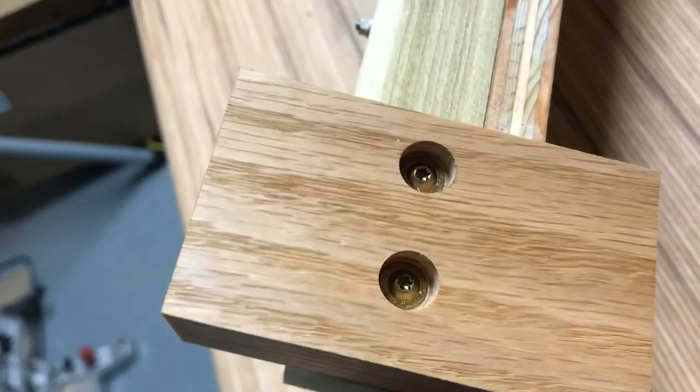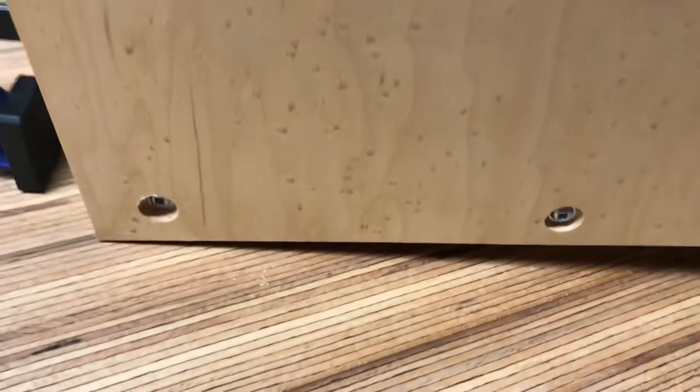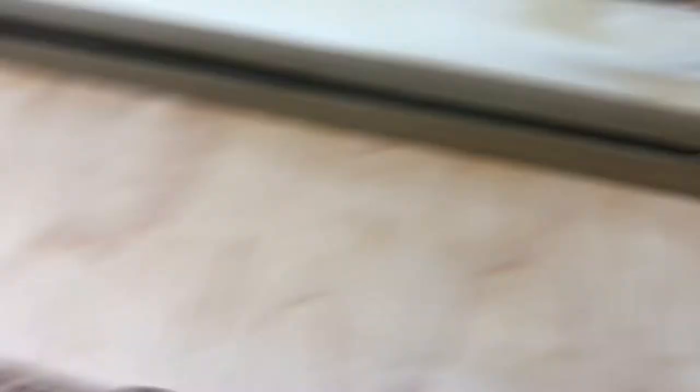Even though it hangs off the table I still used cabinet screws. Out here I just used inch and a quarter Kreg screws. Again, use the Forstner bits — obviously so your materials aren't hitting it — and one machine screw going through that hole where the clamp arm will come out of. So let's see it in action.